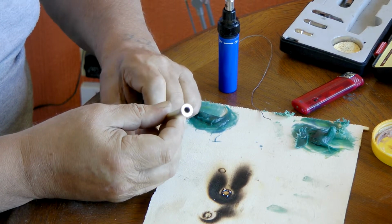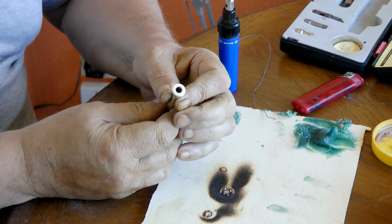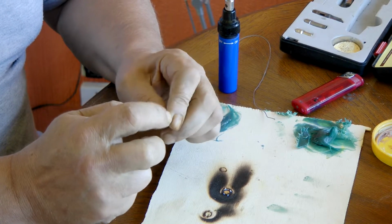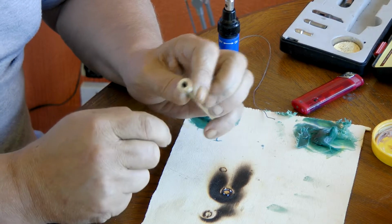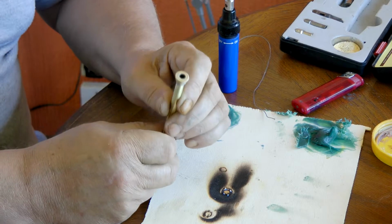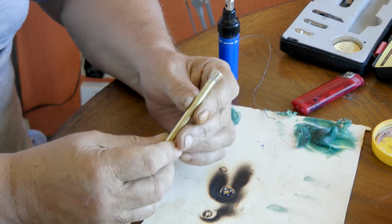Here's a rudder tube. Just made a little ferrule for the top and soldered it on. There'll be a rubber o-ring compressed against that, which when the tube's packed with grease should be the final barrier to prevent water getting into the hull.